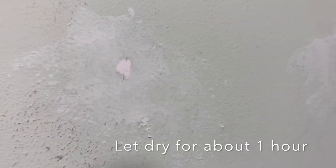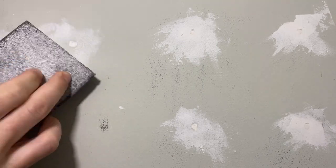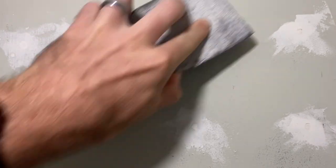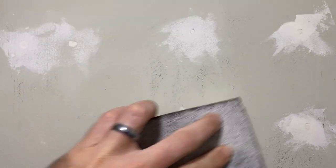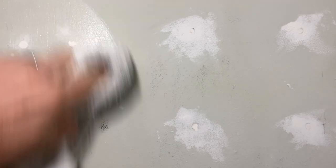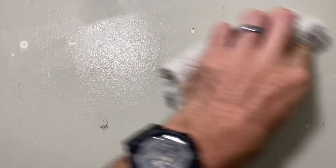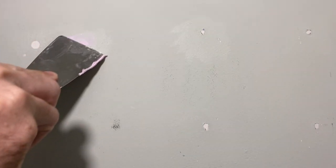That's what your holes should look like. You can see the texture on the wall, so we'll need to match that later. Your next step after it dries completely — you can see it's no longer pink, it is white, which means it's dried completely. Now we're just going to sand it all to prep for the second application. I'm a big believer in less is more, so I'll take a wet rag and just wipe off the excess spackle. You don't need it there — it only makes it more difficult to match the texture later if you have a bunch of excess dried spackle around the hole.